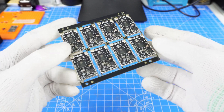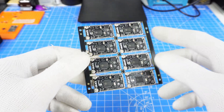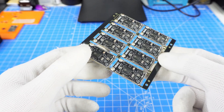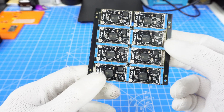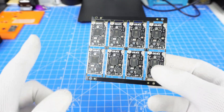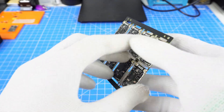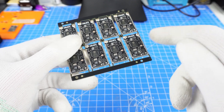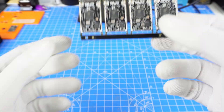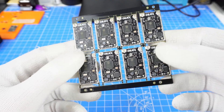The panel is soldered and frankly I'm very satisfied. The pick and place machine made some mistakes placing certain components — mainly 0201 resistors and capacitors — but with larger components it generally doesn't make mistakes after proper calibration. I confess this is actually the second panel I've tested, and I've improved some things regarding the soldering. The pick and place machine also briefly misplaced an RTC at a corner, but I fixed it. I'm definitely faster with the pick and place machine — assembling a panel used to take about 8 to 10 hours.